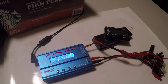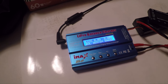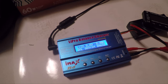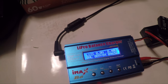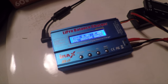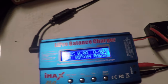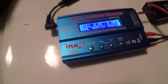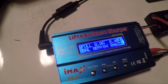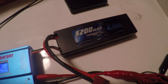This is the last update about the battery. It took 90 minutes to charge only because this is a smart charger — whenever it gets all the way down to about the last 5%, it goes really, really slow. So that's why it took 90 minutes. The majority of this battery charged up at around 30 to 40 minutes. The milliamps in here is 4,632 out of a rated 5,200, but we started charging at 20%, so if you do the math, it actually comes to over 5,200 milliamps.